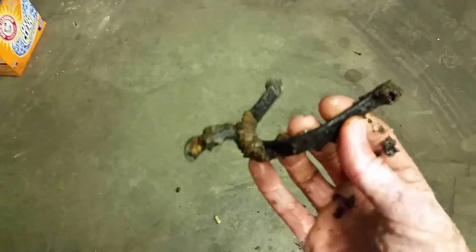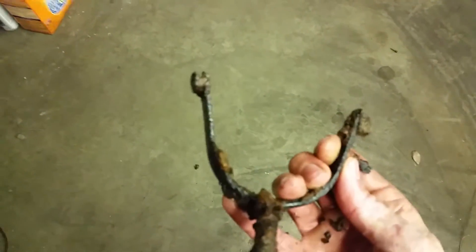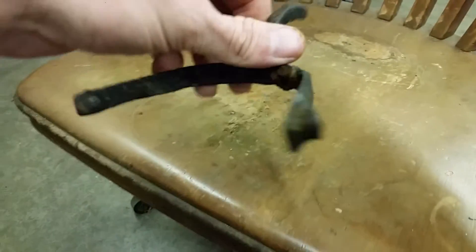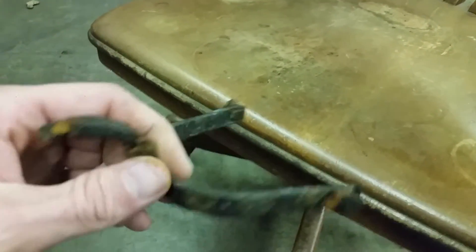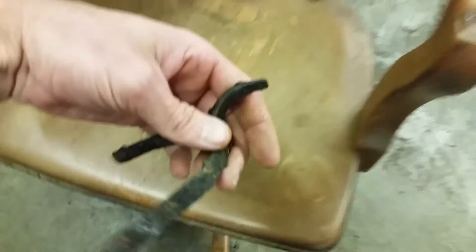This is going to turn out really nice — it might actually be finished. Just kind of give it a check over and see. This is just 13 hours of electrolysis and look what's happening. Here we have the spur and it's pretty much done. I'm not going to do any more electrolysis to it. There are a couple of pieces where I think it's holding on along with some rust, and just a little bit here and there. The wax dip is going to take care of some of this, but I'm not going to push it any further — it's 10 times better than what it was.